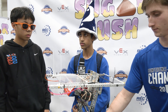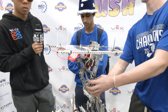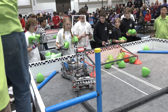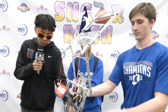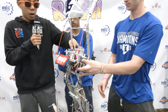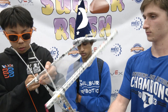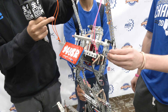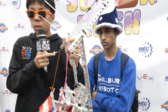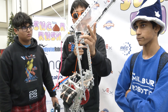Joey, talk about your wings and the blocker we mentioned earlier — you have a really tall robot for your lift but double purpose with that too. So the blocker is mounted on screw joints connected to our four-bar, so we can use the height the four-bar gives us as part of our blocker. This piston retracts and pulls the L-channels in, bringing the first stage up. The second stage of the blocker is mounted on screw joints here — when the first stage moves up, a string that starts slack becomes taut and locks the second stage in place at an angle. We value being able to hang over other teams' match-loading systems rather than going straight up. With our overhang, we're at around 45 inches tall.